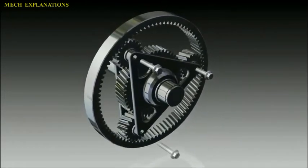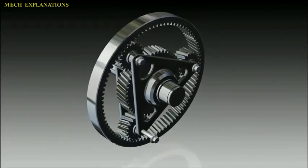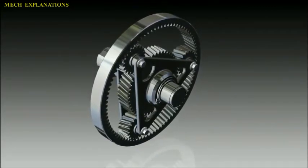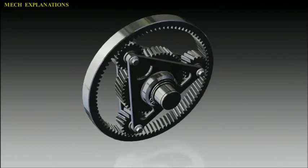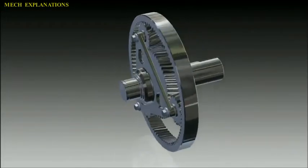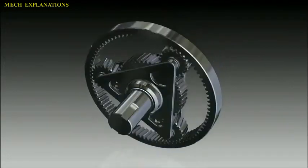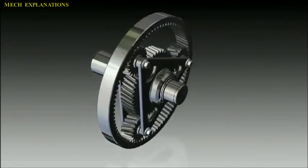An epicyclic gear train can be assembled so the planet gear rolls on the inside of the pitch circle of a fixed, outer gear ring, or ring gear, sometimes called an annular gear. In this case, the curve traced by a point on the pitch circle of the planet is a hypocycloid.